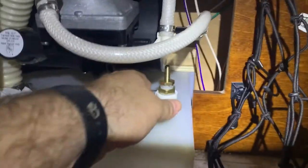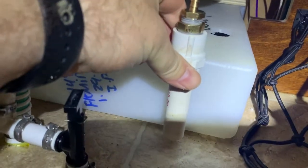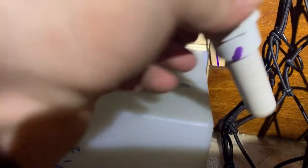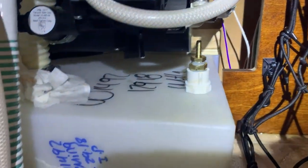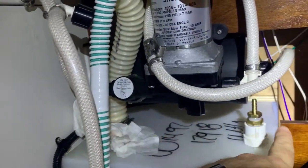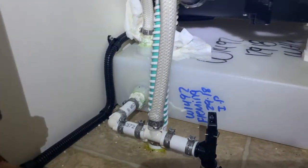So instead, what I've designed is a pickup tube that will extend all the way to the bottom and get maybe 90%. This little lip here I'm going to seal up real good so it won't leak and we can put it under pressure. It fits down real snug like that. Now I need to redirect this vacuum side connector to here so it can pick water up from over there. And this original line I just need to cap off because I don't need it anymore.